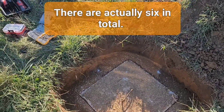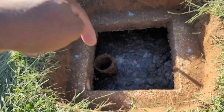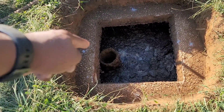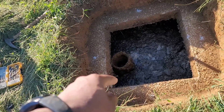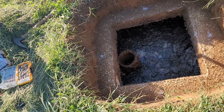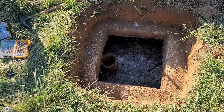Now to put the ring on. The lid is removed — that's the inside, that's the inlet T, that's where the clog was going down. It's been so many years since it was serviced as far as cleaning the T that it built up. Going down there's an extension on the bottom — it was closed like that big — so eventually it got plugged and the stuff was backing up. I cleaned it out and everything started flowing again, and I snaked it.